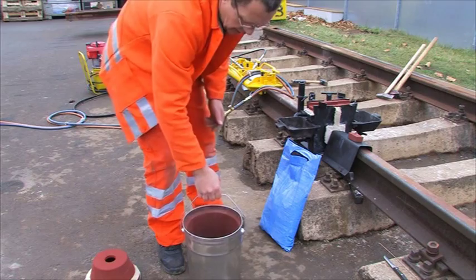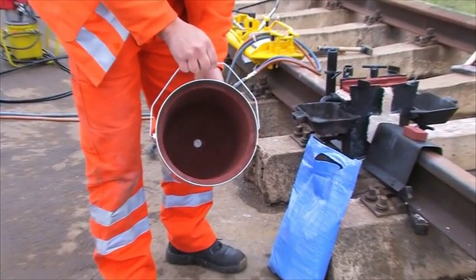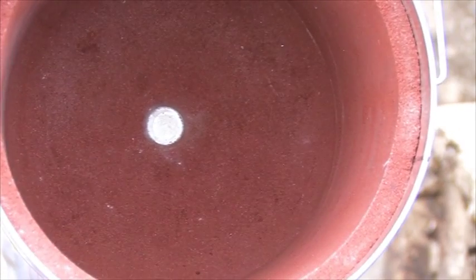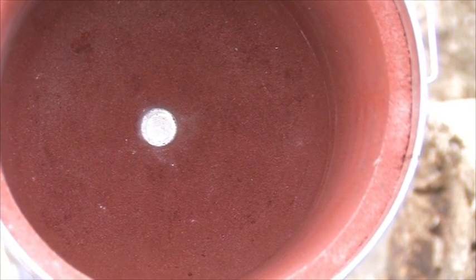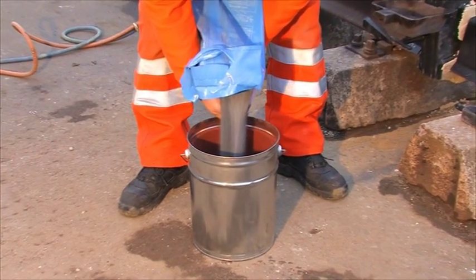Before filling in the Thermit portion, the inside and outside of the crucible should be checked for damage. No sand residues or foreign bodies shall be inside on the tapping thimble. In contrast to the long-life crucible, the single-use crucible need not be dried before using. It should be kept dry and closed.